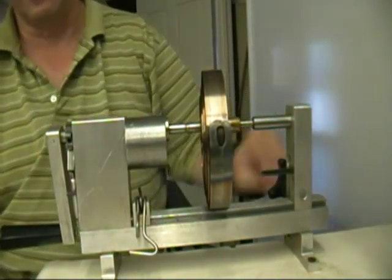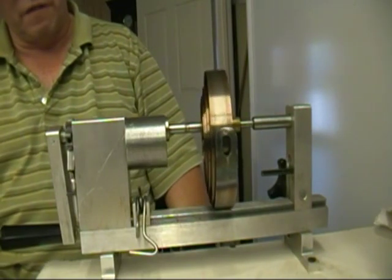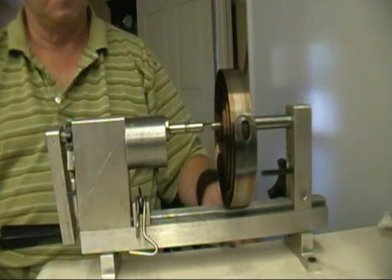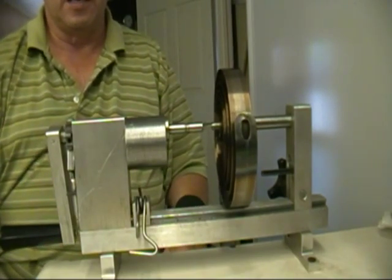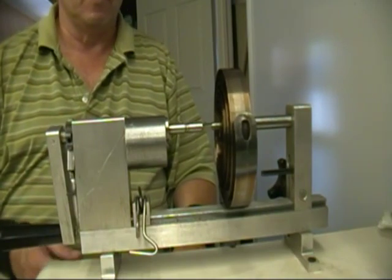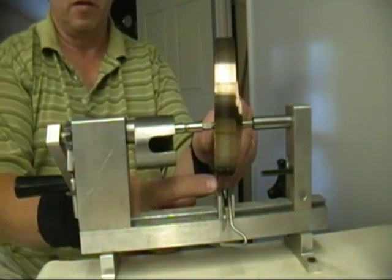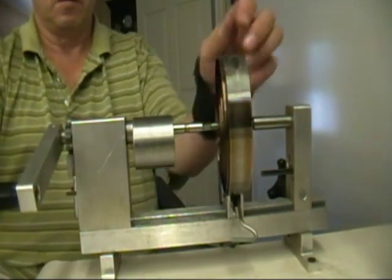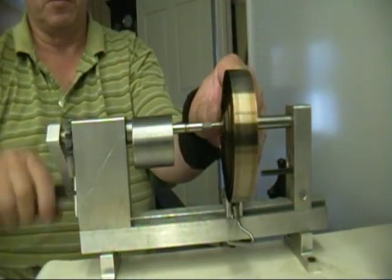And that's it. The spring is only about a half inch greater in diameter now. This one's ready to pop back into the barrel, and only after it goes into the barrel will I actually lubricate it. But the WD-40 does have to evaporate, so I'm going to wipe it off one more time, then put it back in the barrel. We need to put it first into the spring clamp — put the hook on it and try to center this little catch on the bottom, centering it on the spring itself. Otherwise the spring is going to wind kind of funny.